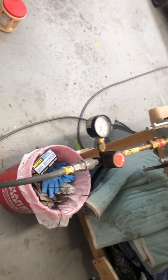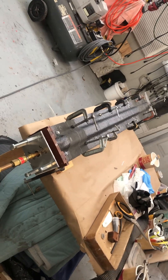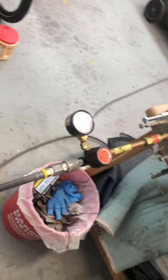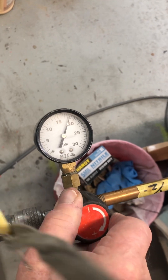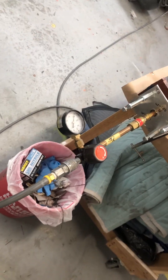I've got the carbon boom maker going again — the bladder mold is at about 15 pounds. A little bit more than 15 pounds. The air compressor probably won't come on much. You can see the epoxy oozing out on this end, and on this end down here I put a see-through piece of plexiglass I cut off a golf cart windshield, and you can see the bladder right there, just oozing out all night long.